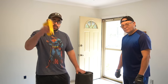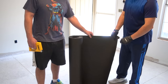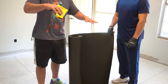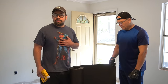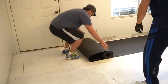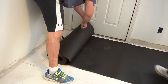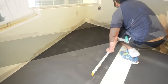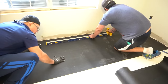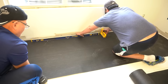After you've cut all your planks, it's time to install. We're going to start by laying down roofing felt paper, which has a dual function: it acts as a water membrane and it also helps reduce creaking from wood on wood. You don't have to do this, but we wanted to do it right. The Latino Engineer and my dad began rolling it out, then he used a hand stapler to attach it while using a large level to keep the paper flat as he stapled.